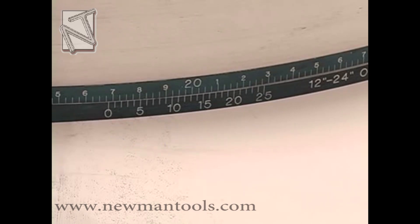Locate the zero on the Vernier scale and note the highest value achieved on the gauge scale above it, which is the highest value to the left of the zero. In this example, the value is 19.675 inches.